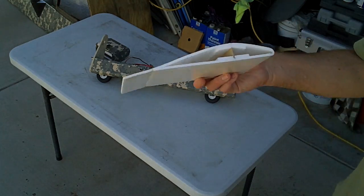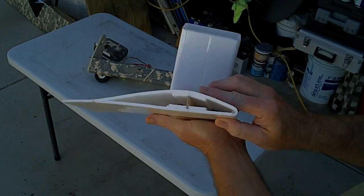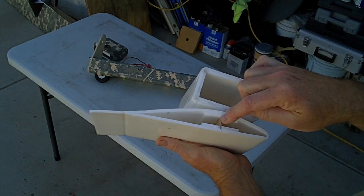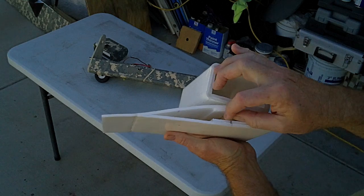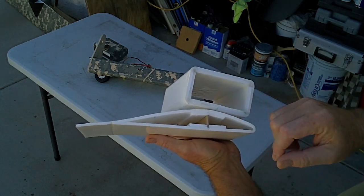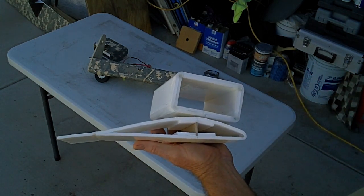So this is what the wing looks like, in this wing that I have on the phone, on the FBDrone. Instead of plywood, this is actually solid wood right here, a thin 1/8 inch rip, 3/4 of an inch tall, and this is poplar. You can use maple, and it was continuous. It was 60 inches. Lined up on edge like this creates an I-beam. It's extremely stiff. Better than round, better than square dowel any day.